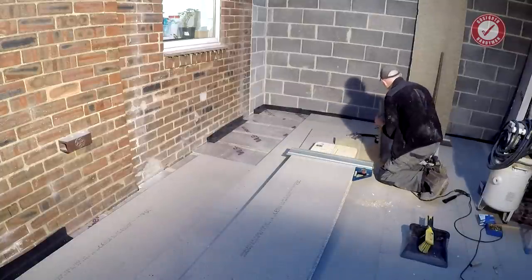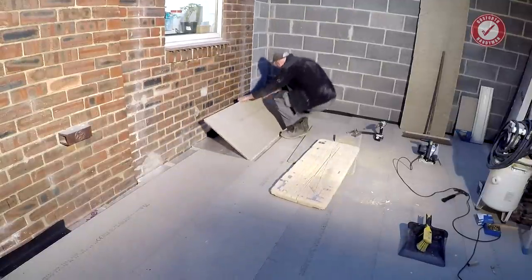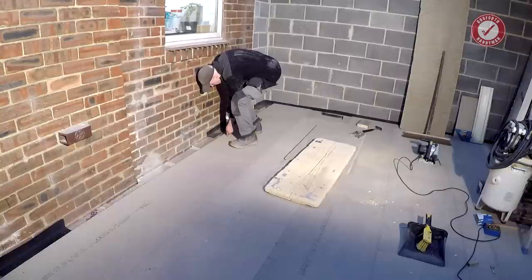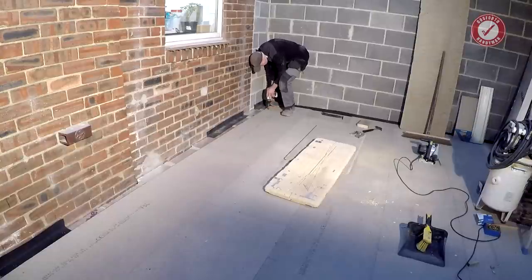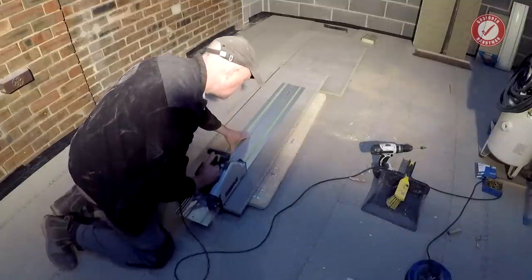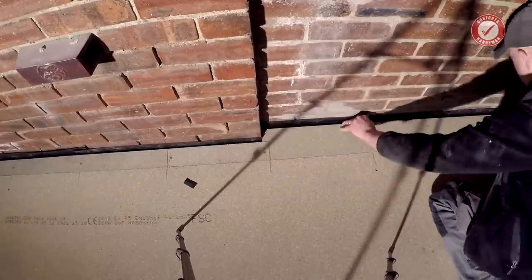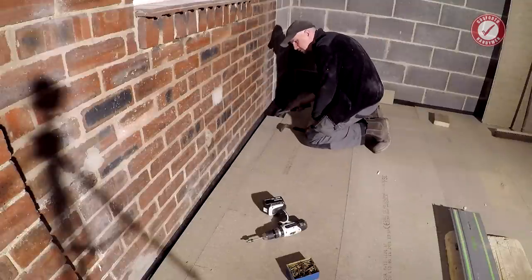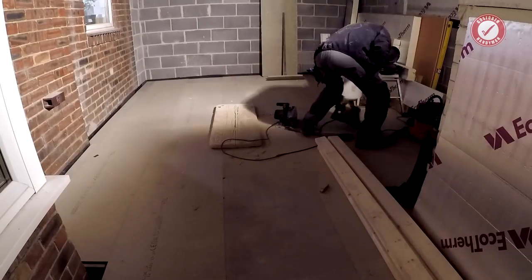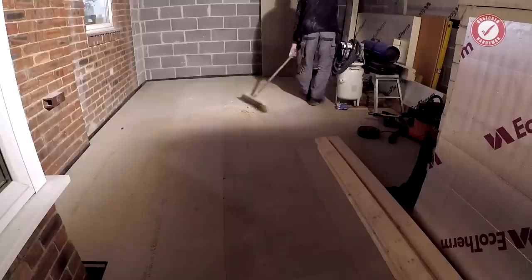Now I know what a lot of you are probably thinking — are we gluing the floor down? In a commercial build at this stage you would absolutely be gluing the floor down. But because this is a self-build we've got a little bit more time to play with, and we've got a couple of lulls coming up in the project, so we've taken the decision to leave the floor dry for now, just in case there's any chance we need to get back under it. I don't think we do need to, but now that all the boards are cut and fitted, it will take me literally 10 minutes to lift the floor and glue it down a little bit later down the line. I'm just not rushing into doing that because I'll guarantee if I do, I'll find something I want to put under the floor, or I'll accidentally drop something down an edge that isn't sealed yet. But at the moment our top priority is to get a floor surface down so we can get the ceiling insulated and plaster boarded.